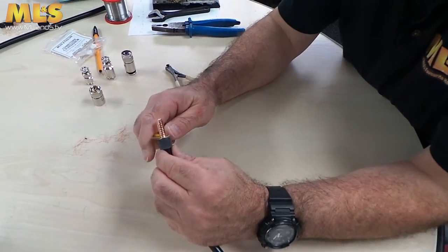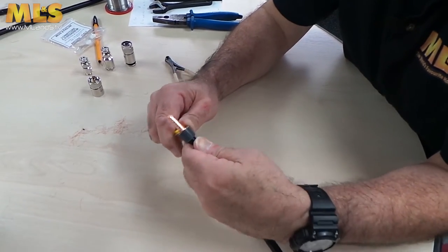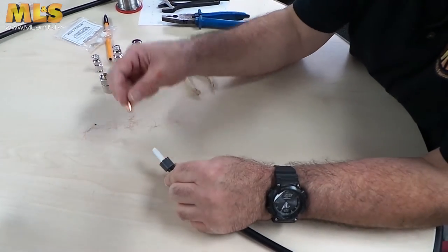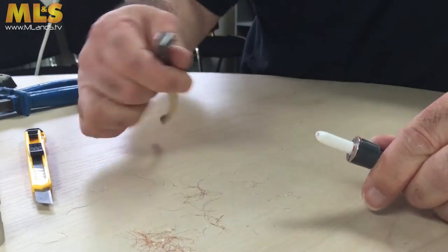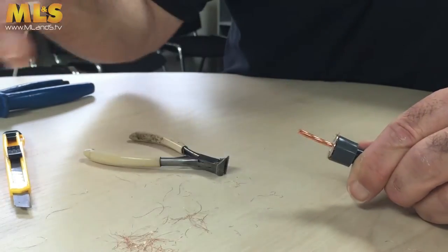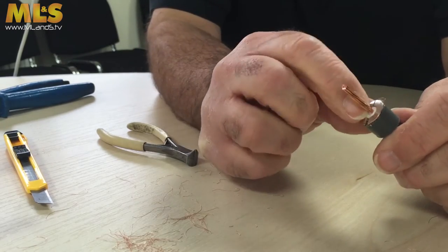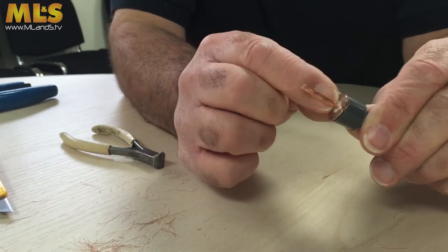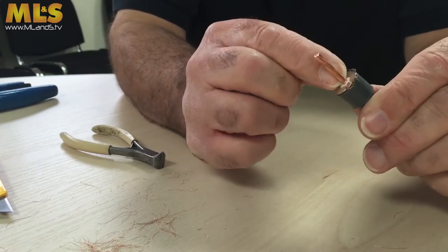Next, you take this and you trim very carefully the copper sheath and the inner insulation. But don't cut right down to the core conductor - just enough to break it, and then you can get that off. You might use a pair of wire cutters to gently tease this out of the way to get it started. So that's what you want - that should be flush. Now an important thing to check here is that there's no shorts between either the braid or the inner conductor and the copper sheath on the outside, so that should be all clear.